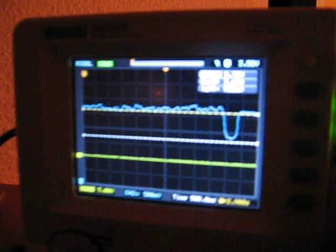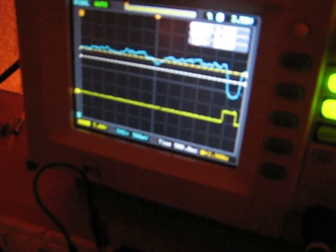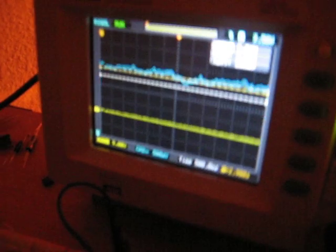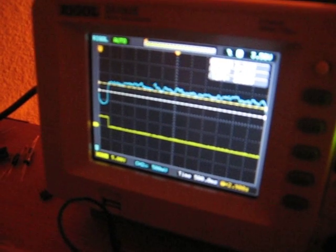Lessons learned: clean up your optical signal before you start cleaning up your electrical signal. Cleaning up the optical signal in this case means isolating it — I should cover up the little window on the meter completely so no stray infrared can get in. It also means fixing the little tube permanently so it won't wiggle, and the same is true for the infrared LED emitting light onto the disc.